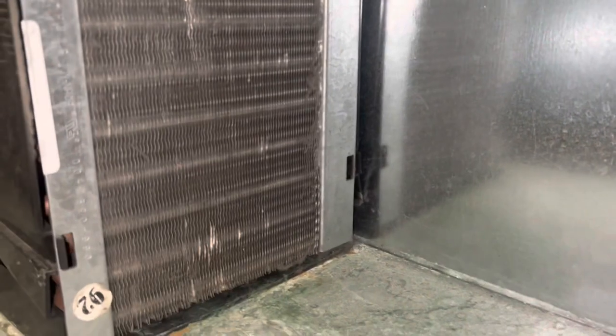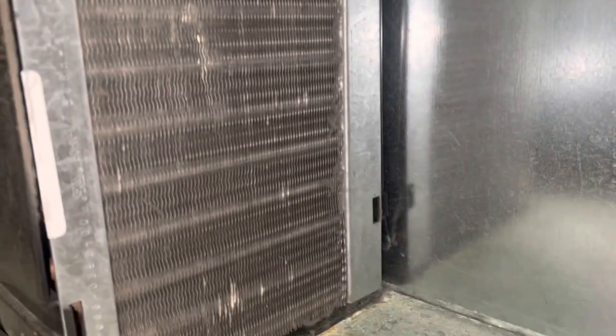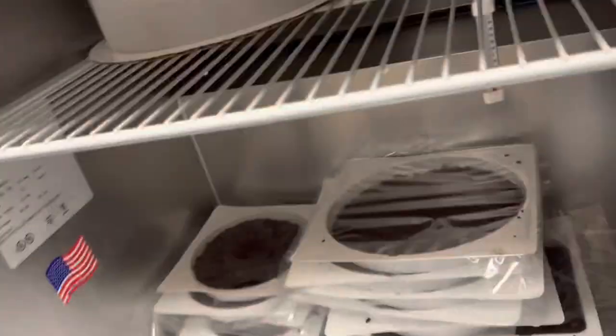This is the difference in mentality. I should do nothing — close this up — and in another month or two, this unit will be dead. It may even burn out the compressor, then I'll have a big job. But no. We're here — clean it up. I don't want a return call. Take 10 extra minutes — I meant one. One minute. Clean the coil.